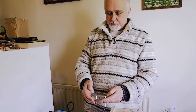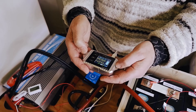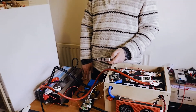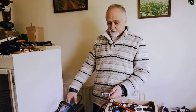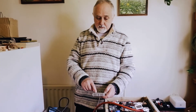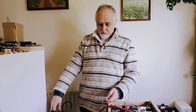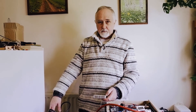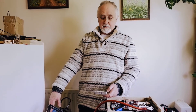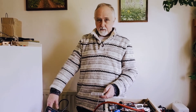Looking at the cheap shunt, we've used 5 amp hours from the battery. The Victron shunt reads 4.9 amp hours — very close, and both started at zero. Including a bit of standby consumption, we're at 5.012 amp hours. So: five amp hours to make two really delicious cups of coffee. Our battery has gone from 100% to 99% — in this particular case we used roughly one to two percent of the 280 amp hour battery's capacity.